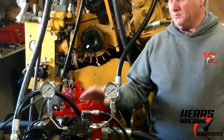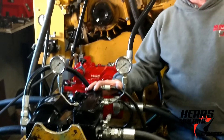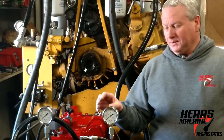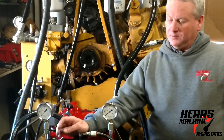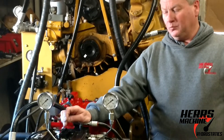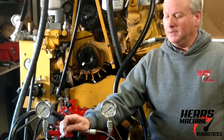What we're going to show you today is the two-speed control valve, and what it is, it is a pressure response control with a stroking valve. It's a two-part valve, the first part being the 12-volt coil. When it's on, it directs the swashplate in the motor to minimum displacement, and when there's no current to the coil, it directs the oil to the opposite side of the motor swashplate to drive it into maximum displacement for lower speed, higher torque.